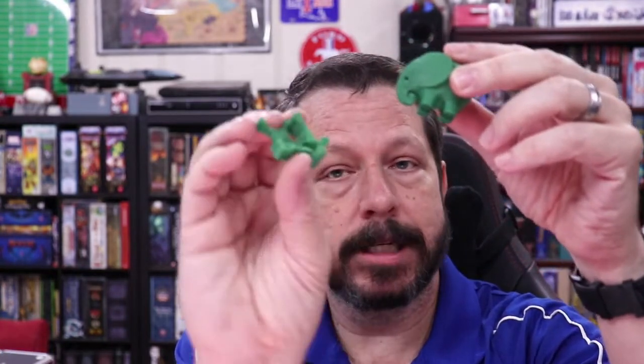There are other kinds of supports that we'll talk about later on. With this particular style of printer, the other types are not typically used because it requires two different nozzles or some way to change filament so that you can have the support waste material easier to remove from your model. But this printer is not really set up for that, so we'll have to bring in some other printers, or at least look at other printers to have that option. But all of your printers have this option, and you don't have to design this yourself. Actually, you can. If you're designing a part from scratch, you can intentionally design breakaway support material so that it's exactly the way you want it.